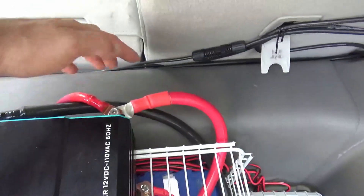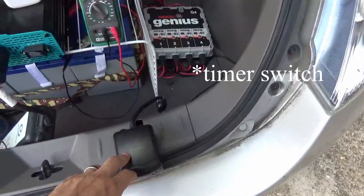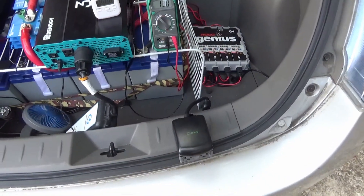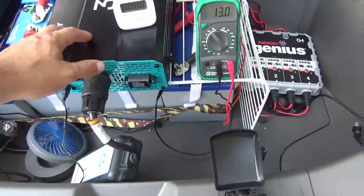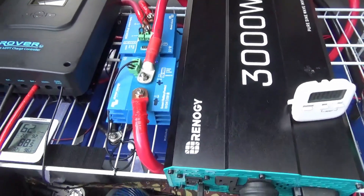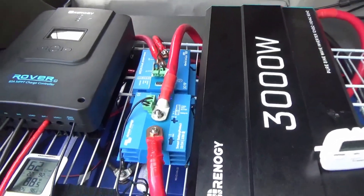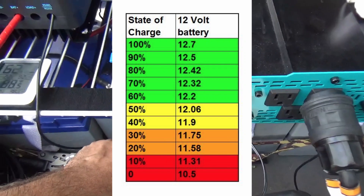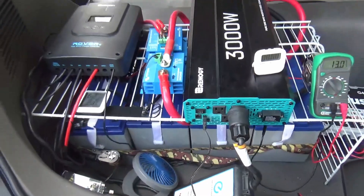Basically this pulls all of our positive current from the batteries through these two battery protects — these low voltage cutoffs — and takes that to the inverter. So why do we even bother with all this if we've got our charger right here? Well, the timer is an acceptable workaround, you can certainly use it, but you're still ultimately eyeballing it — you almost have to do it on a day-by-day basis, come outside and think about how much sunlight you're going to get. With these battery protects, if they work right, we should be able to just plug the car charger in and walk away. You can program these to cut off at any voltage you want; I have them set at 11.8 volts, because that's about 45% of the charge remaining in these batteries.